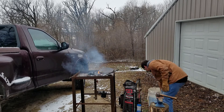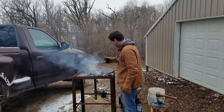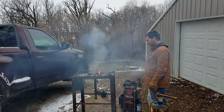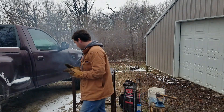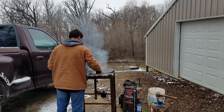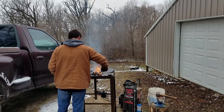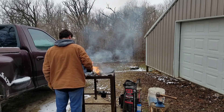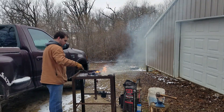Now I'm pouring in some actual coal. This coal comes from a 50-pound bag I bought at a farrier shop. If you notice the smoke — when the coal starts burning it starts to turn a little bit yellow. That's the sign that your coal is finally starting to burn. Coal actually only produces smoke on the initial entry. When you first put in coal it will smoke, but after it gets good and hot it will stop smoking and you'll have a smokeless fire.